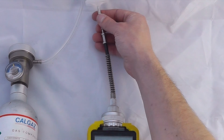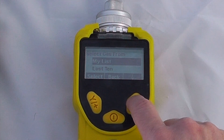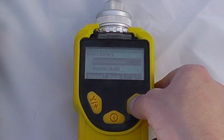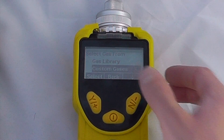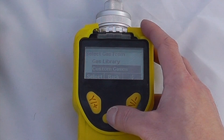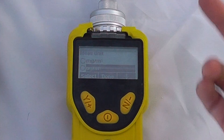Reapply the hydrophobic filter to the instrument. Going back into the menus, we also get the option for measurement settings, such as our measurement gas. Selecting that shows the last 10 gases used or the total gas library, where you can input preset correction factors for any gases you may want to measure. We can also do custom gas settings if you have a standard calibration mix and want a custom correction factor. We can also look at measurement units — parts per million, milligrams per cubic meter, or micrograms per cubic meter.